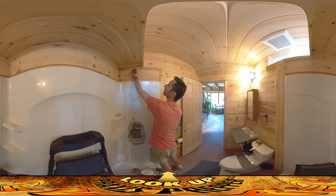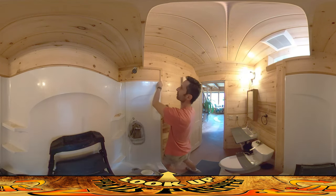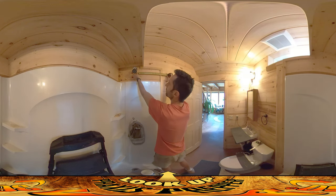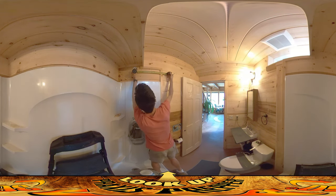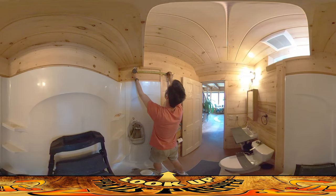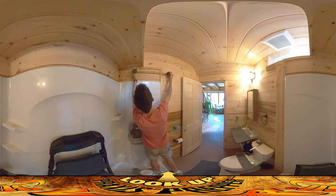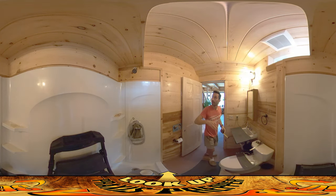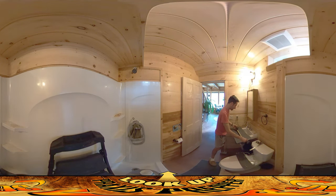Now these little shower things oftentimes have a little ring that goes around it that just slides right away. What I'm going to do is find out how far over this thing is and how high up it is and locate it that way. The center of this is just about 16 and an eighth inches from that side on the tile.